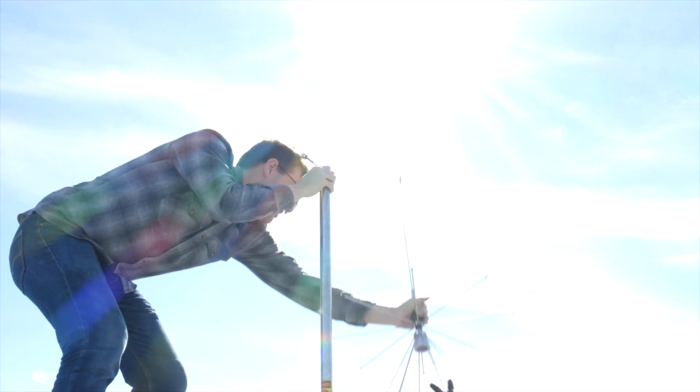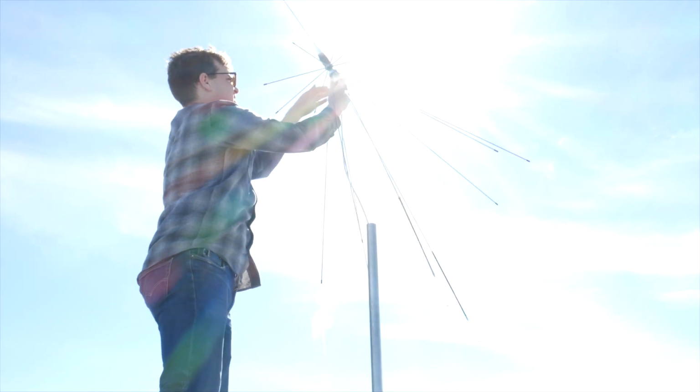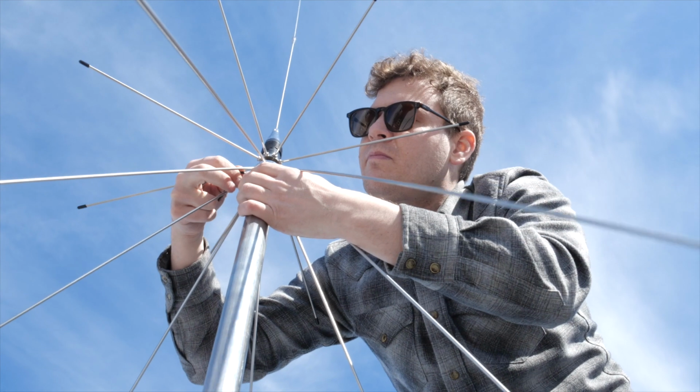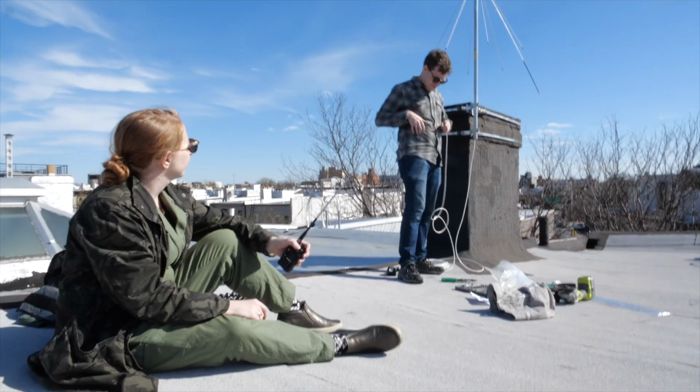We brought the antenna close to its mounting position atop the pole, then plugged in the cable and tightened the threaded collar. Threading the remaining cable slack back into the pole, we then seated the antenna atop the pole and tightened the set screws.